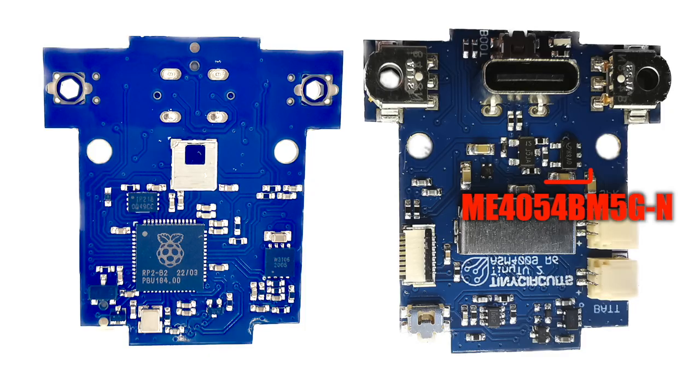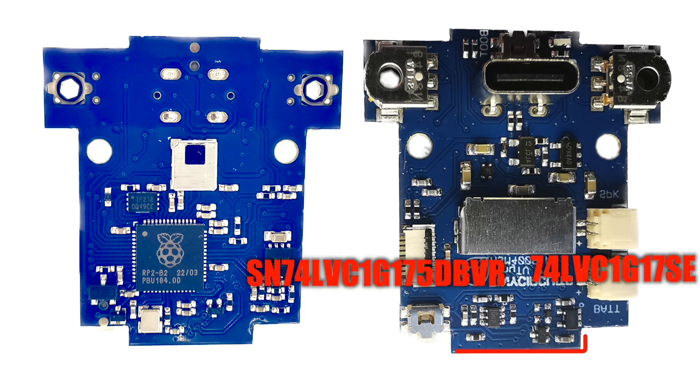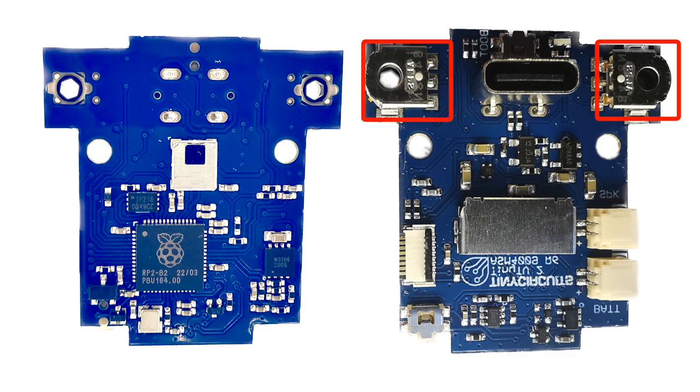On the other side we've got the 5-pin battery charger IC, and this tiny little chip here is the low dropout regulator — you can barely see it. Amazing! All this stuff up here is for the soft power switch and power path. These two rotary encoders handle the volume and channel switching. All in all, it's a really nicely put together bit of kit. I like it.